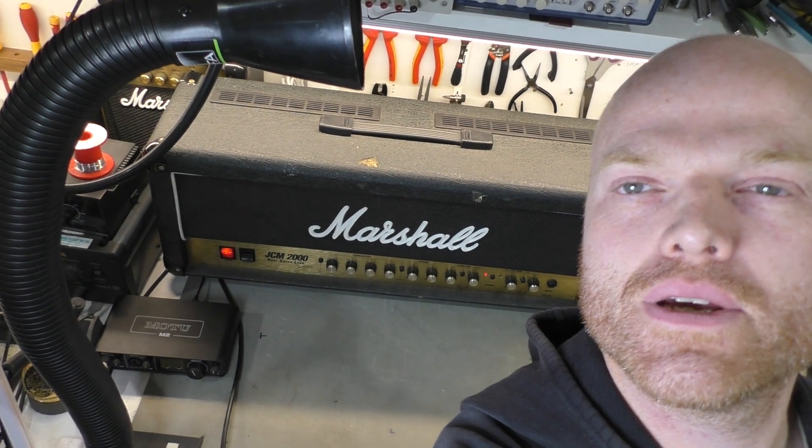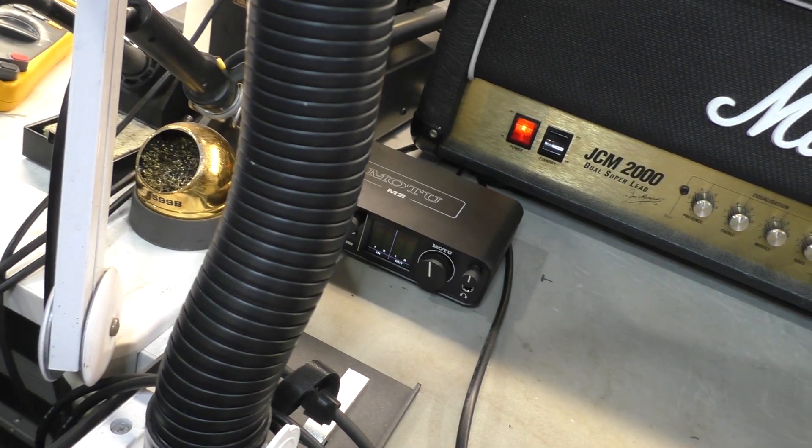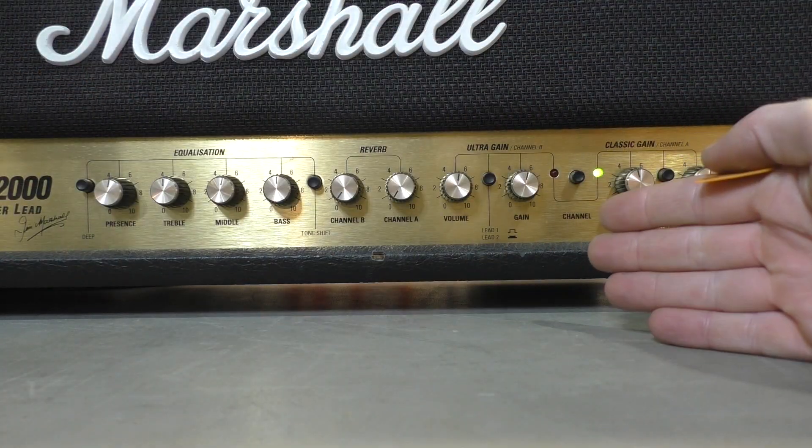Alright champions, here's the setup. We've got a Marshall and it's got a bit of a hum from the power transformer — not brilliant, but it's drawing reasonable current. Short of replacing the transformer, which may or may not fix it, there's not much we can do. It's an audible hum from the chassis, not from the speaker. We'll fire it up with the old Stratocaster faithful and see how she sounds with the close mic. The little MOTU interface down there is getting its baptism by fire with a 100-watt Marshall going into it.